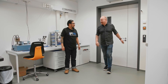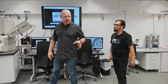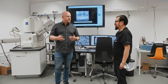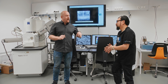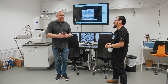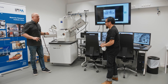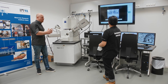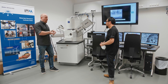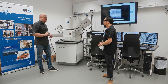Welcome to the basement — our electron microscopy lab. As I said, when the resolution of the light microscope is not sufficient anymore, we go down to electron microscopy. We can do all the correlative microscopy work here — easily finding areas of interest in the light microscope and then in the SEM, as we have both Zeiss systems and they communicate with each other. What we have here is our Sigma — basically our workhorse SEM with all the analytics: EDS, WDS, and EBSD for chemical analysis and crystallography. All our research groups — additive manufacturing, magnets, batteries — use this system. It's very highly frequented.